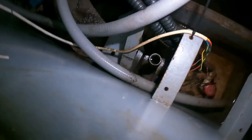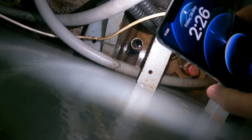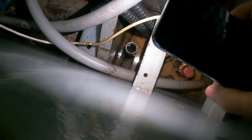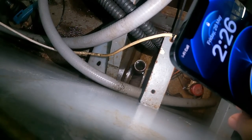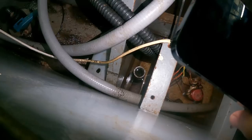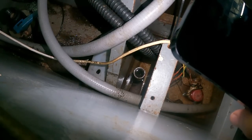There's the cables for the Raymarine transducers, which are quite waterproof — which is great — but that is quite a bit of water to bail out. It's actually right down there. You see that pipe there — once the water gets to that level, it comes in. It's actually threaded, so if I put a cap on that it'll stop water coming through there. It was part of the whole sea chest Jabsco manifold system that is long gone.